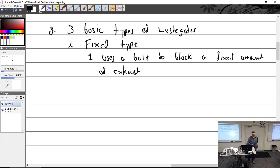So I said the Piper Senecas have that. It's set at the factory. I remember in Lycoming school, we were talking about turbochargers, and he gives this big scenario: you're not reaching critical altitude, you're not getting the boost you want. How do you fix it? The answer he was looking for, and I fell right into it: well, you screw the bolt in, it'll stop more from going overboard, more to the turbo. And, no!